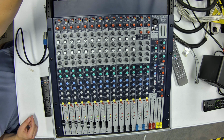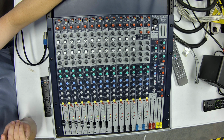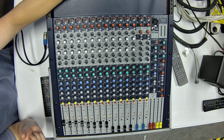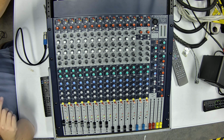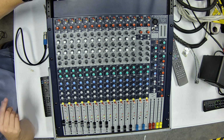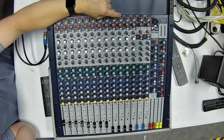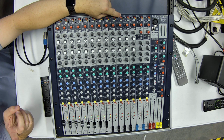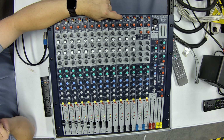This one is a condenser microphone, or a capacitance microphone, that is essentially a big capacitor. A capacitor is an electrical component that stores energy, okay? And the capacitor requires electricity in order to operate. So you have to either put a battery in it. Some of these microphones will let you literally put a battery in them. This one doesn't, but some do. Or you have to provide it with some electrical signal in order for it to operate. So this first button here called the phantom power or the 48 volts, if you turn that on, it sends a direct current voltage signal down the microphone cable to power the device. Then the device sends back audio on that same cable, okay? So if I turn this button on, suddenly I get signal.